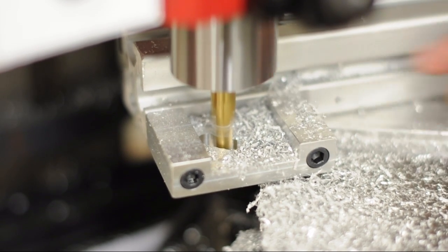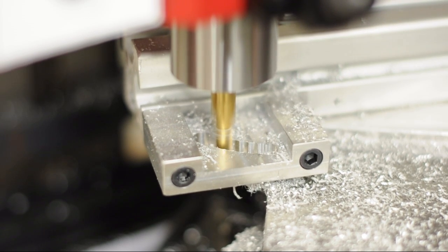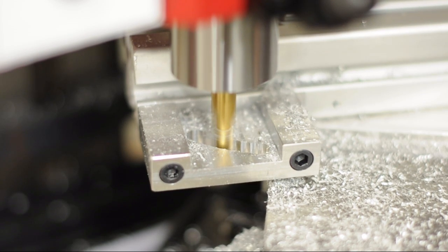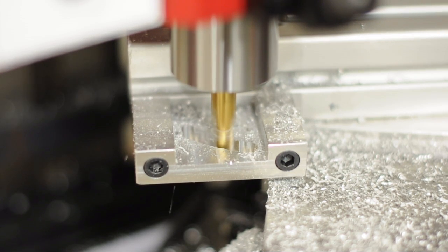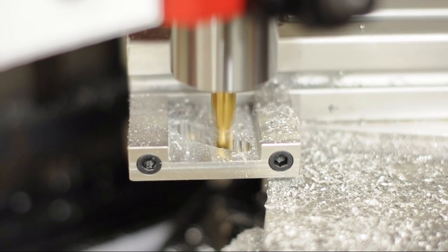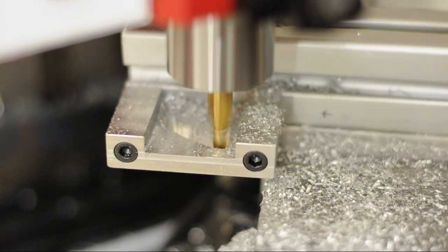And then for the last step in this process, I took a mallet because I need to clean up those little jagged edges. So I pretty much extended the mill all the way down and then using a mallet I was tapping the extrusion to get it to turn in little tiny increments. I had no idea if this was going to work and I actually thought I might break the tool doing this, but it actually worked out a lot better than I thought it would.